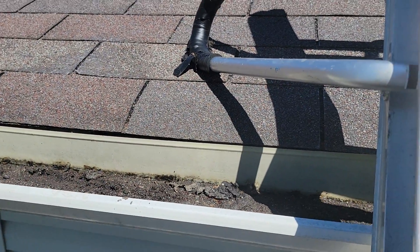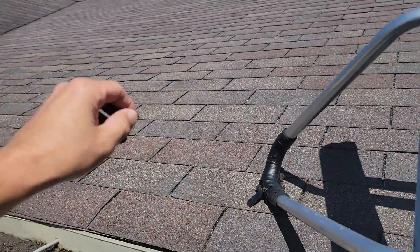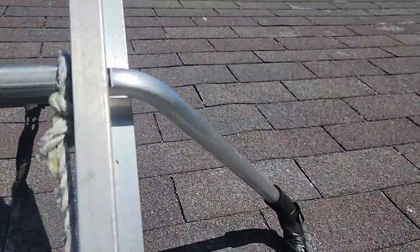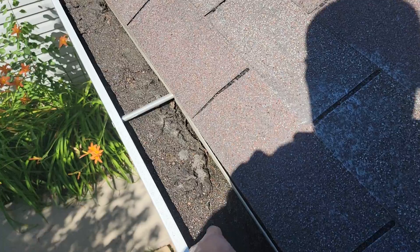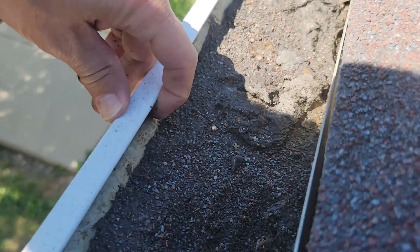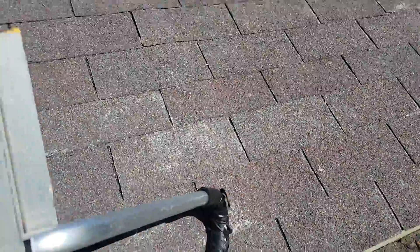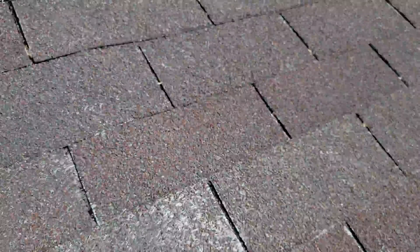This gutter needs cleaned out - take the wood debris out of it. This roof is just shot. To summarize the signs: granules gathering in your gutter, and the look of the roof itself. Before your roof looks this bad, you're going to see granules gathering in your gutter. This gutter is damn near full - it's everywhere across the entire roof.